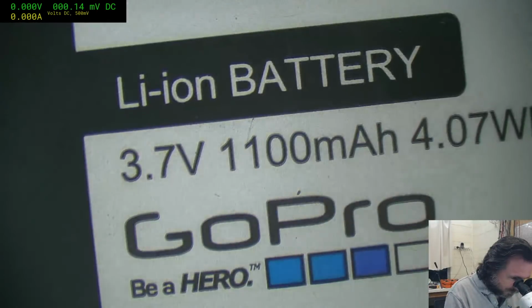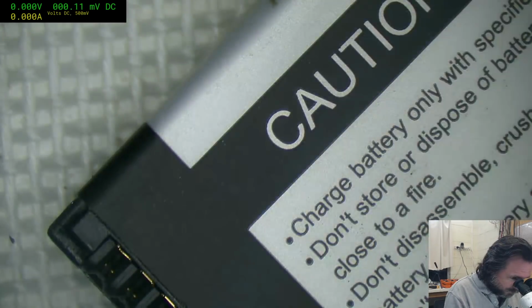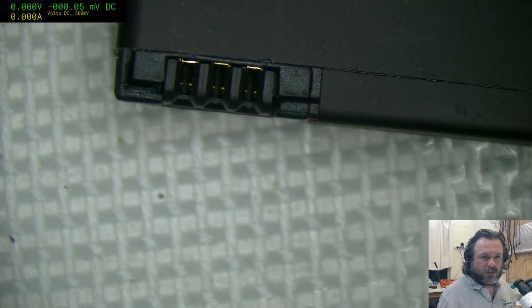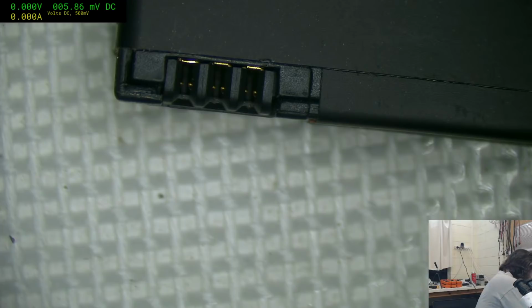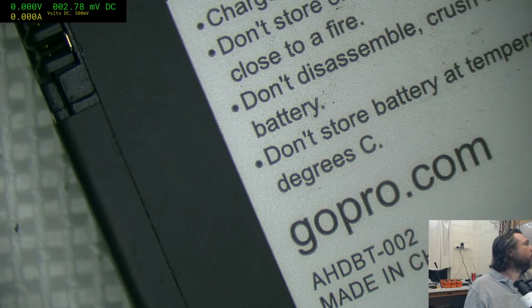Now let's see, what are you? You're 1100 milliamps, so 110 milliamp should be an acceptable sort of bootstrapping current. Now I need my multimeter probes to do this. Be careful, I don't want to needlessly stab myself today. So yeah, we will set it for 4 volts. We're going to go for 4 volts. And let's call it 110 milliamp, yeah.